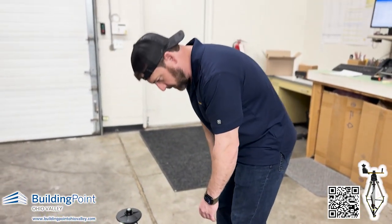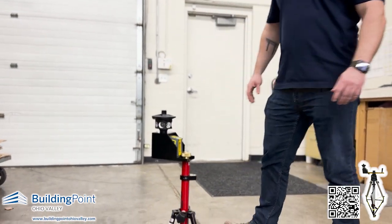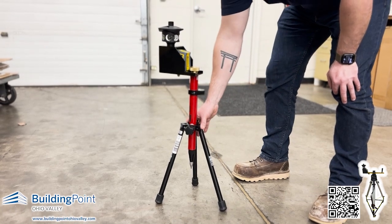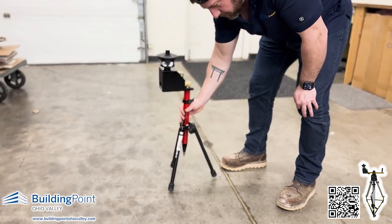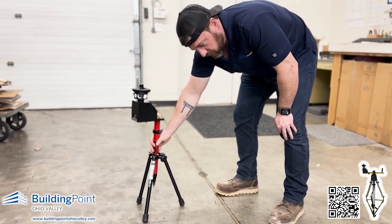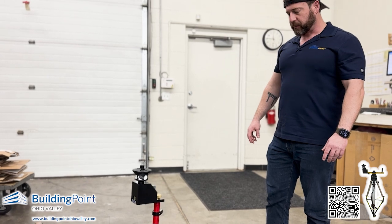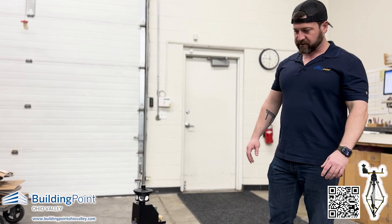One of the aspects of why we made the LTP 526 modular was that you can use any standard surveying accessories with it. Some of our masonry contractors use this configuration because you can actually set the legs to be just wide enough to fit a masonry block. That way one person can do his own layout and marking — he just moves it right down the masonry block, and once he's got it where he wants according to Field Link, he sets it in there, he's got his point, and he can just make a mark. You can also use this for any application where putting the whole pole or cart might be too tight of a fit — you can just stick this right in there.